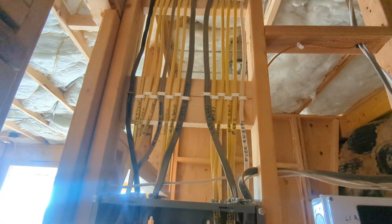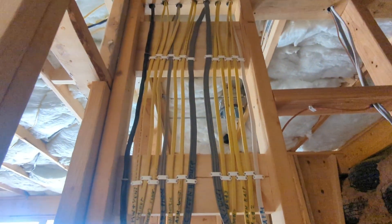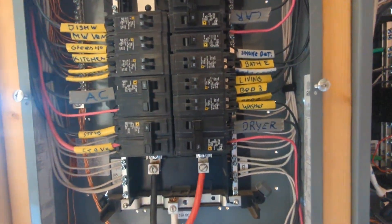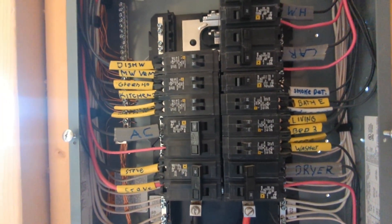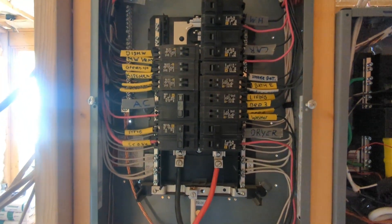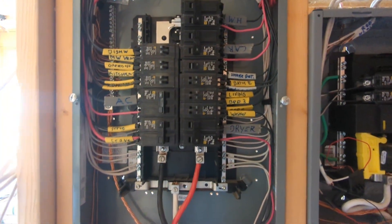Just a trick from when you lay your wire: name them everywhere and have them nicely organized, and name where they go. Then you can write it here again on top. And as you strip the wire, just keep some of the stripped casing and you can write again where these electrical wires go. That way you'll never lose track.